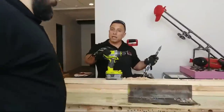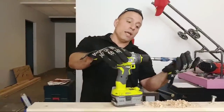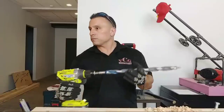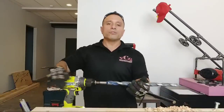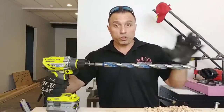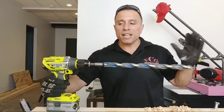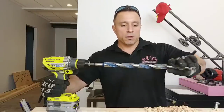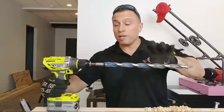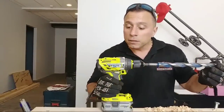You're going to time this? Yeah, I'll time, and then depth. So what I'm going to do is start this out on two and see how far I can get. Nick, you have a tape back in the bag? I'm going to start the drill on number two, because the faster speeds help expel the shavings of wood out of the hole and allow it to move forward. The problem is as you get deeper into the hole, there's more friction on the drill bit, and it will slow down. There won't be enough torque to spin in number two. So then I might need to switch over to number one, the higher torque setting, to keep it moving.